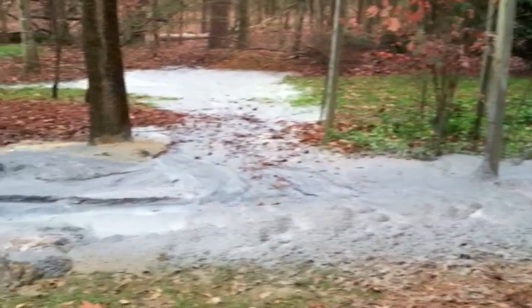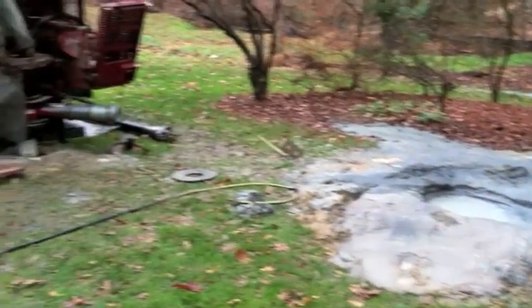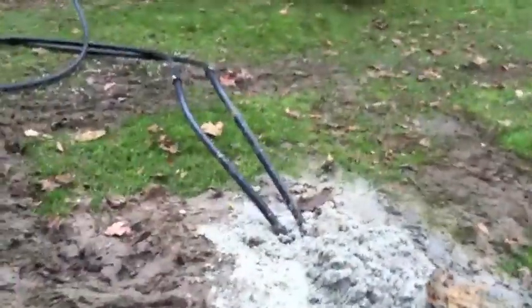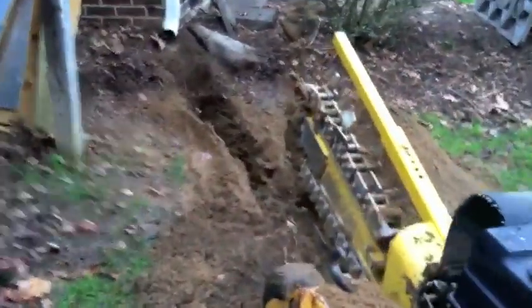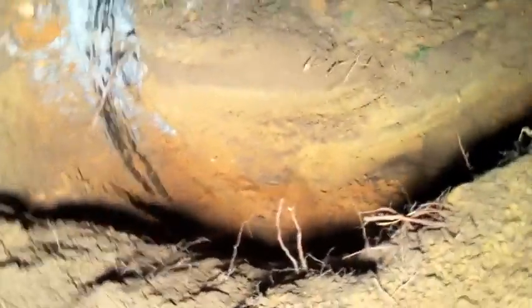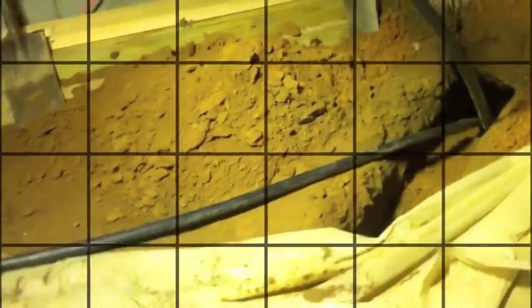This is the grout pump. Drilling does make a pretty big mess — this is basically ground up granite rock and well cuttings. Here is where they are pumping grout back into the hole. After they were done, I rented a trencher to dig a trench about 3 feet deep from my crawl space out to the well. I hand dug next to the well to make sure I didn't damage the pipe, then dug it under the foundation and into the crawl space.